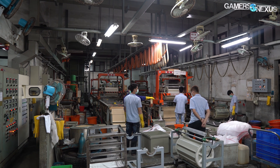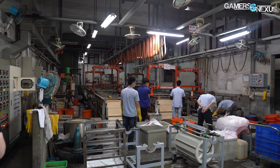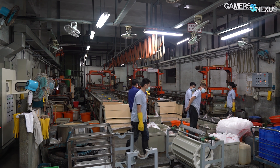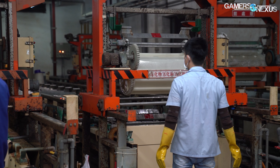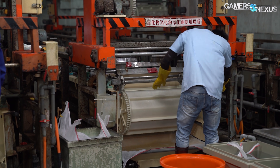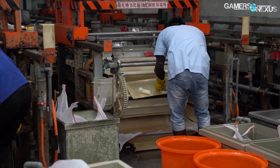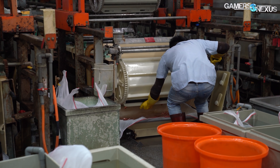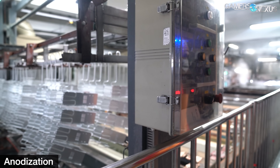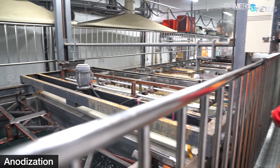The cleaning process for the small parts being coated in barrels takes an hour, as opposed to eight minutes for the larger rack-mounted parts. This method of plating makes it easy to process large quantities of small parts uniformly, but the tumbling and random contact between parts means it's not the most precise method, and it's only usable for parts that are compact and simple enough to roll around each other in the barrel. Customers pay a premium to have items rack-coated by exact count, but barrel-coating is simply done by weight. This section of the factory uses small cranes on rails to lift the barrels in and out of each chemical bath, like miniature versions of the cranes used at the anodization factory.